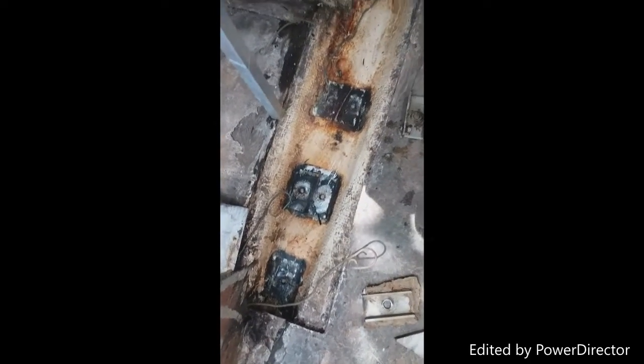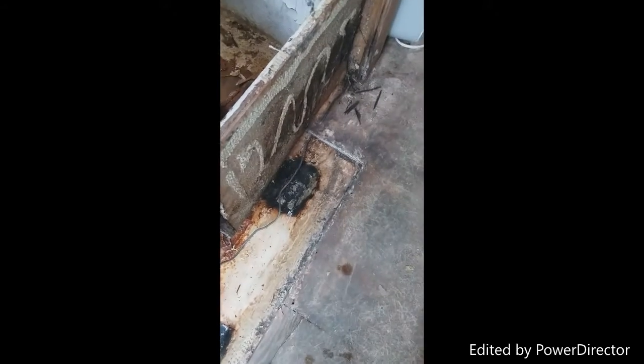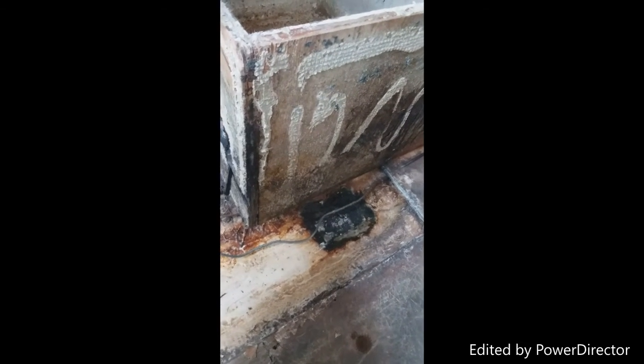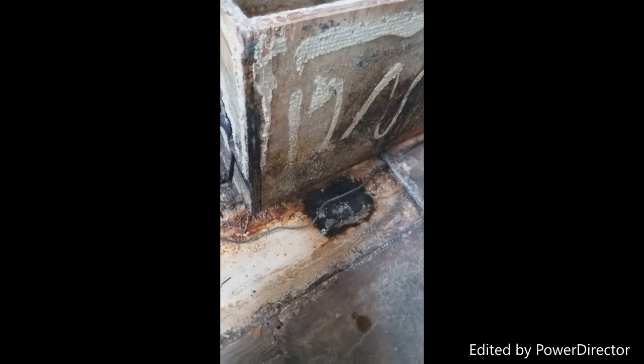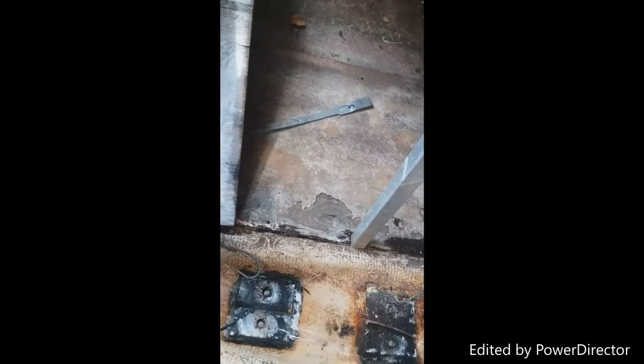Here's what she looks like with the bolts out and the keel lifted. Well, the boat's actually lifted off of the keel. I'm going to leave the keel bolts sticking into the hull a little bit so that I don't have to try repositioning it. That's only a 1,300 pound keel. That isn't bad, but it's more than I can handle, I believe. I watched another guy, I believe he had an S2 sailboat, and his holes from the keel rocking side to side for so long, his keel bolt holes were oblong.